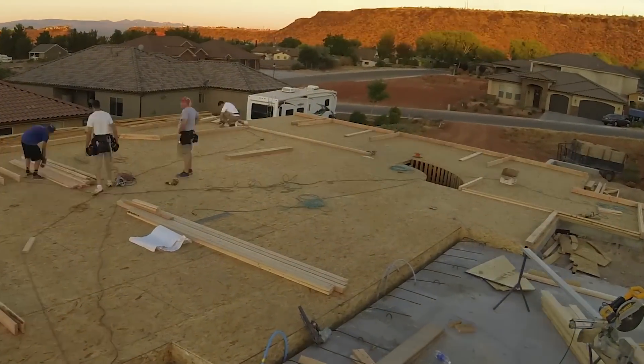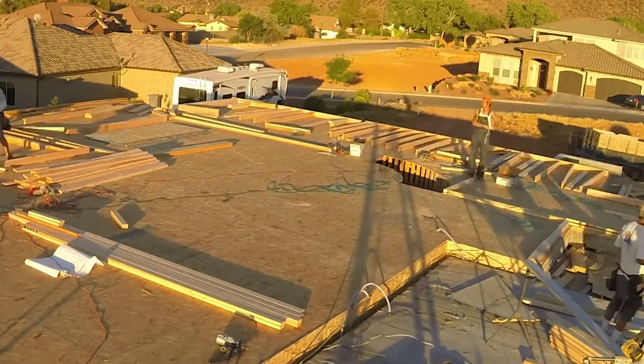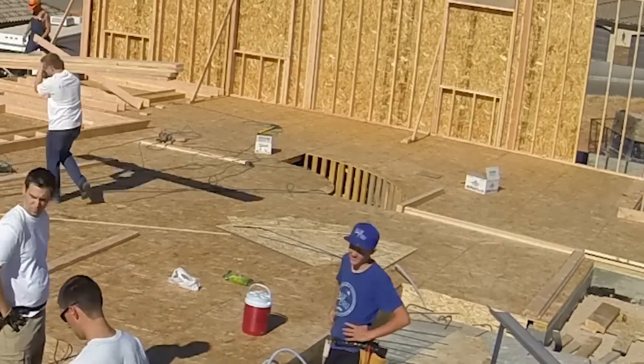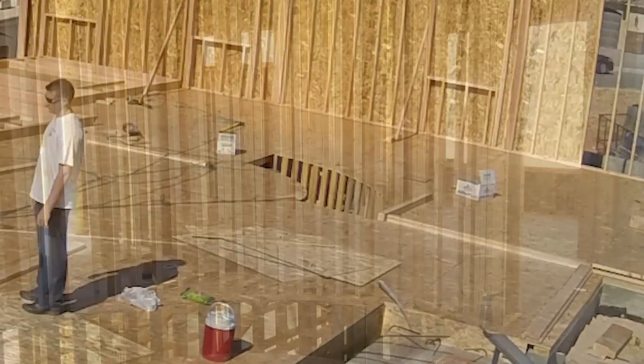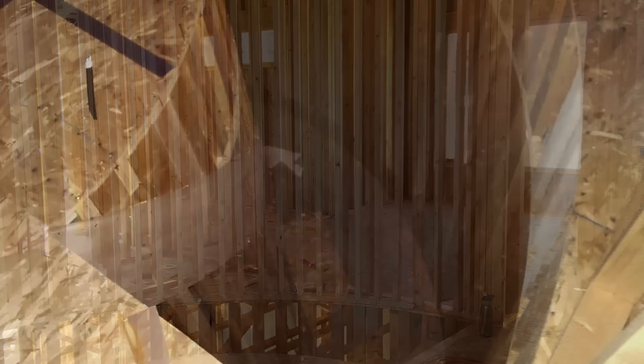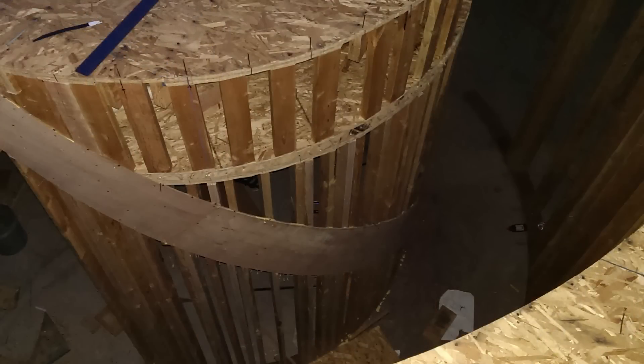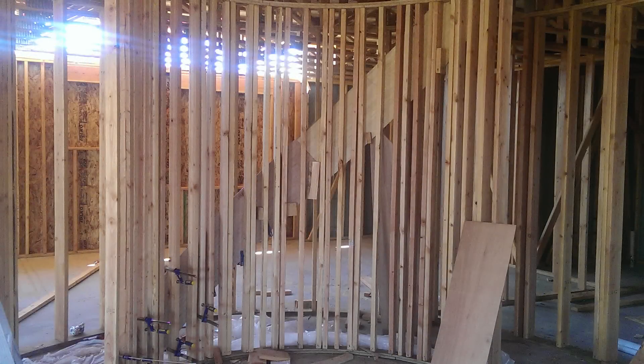My stairs traveled between the main floor and the basement, so the glory of the freestanding stringer is only visible from the basement. I know it's not ideal, but I couldn't afford to build another story on top. I built a round wall and began bending quarter-inch sheets of Luan plywood, which I cut into 16-inch strips and attached them to the curved wall using Titebond original wood glue applied with a paint roller, and 18-gauge one-inch by one-eighth-inch crown staples.